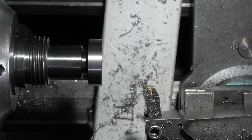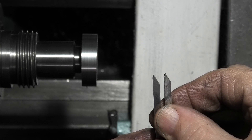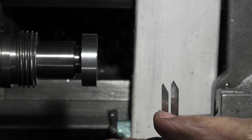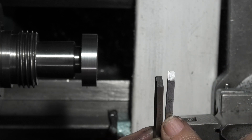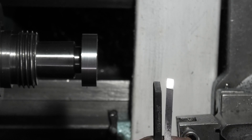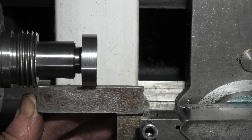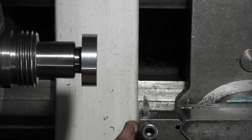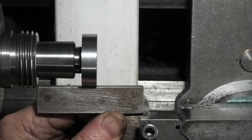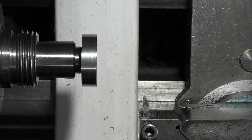Half a thou lift — I'll leave that. I have two thread cutting tools here and the one I want is the 55 degree one. The only difference between the two is one is 60 degrees and one is 55, and it should tell you on the tool itself. I'm using a square to get the tool square to the part — ensure that the edge of your square is on the tool, not on the tool holder. It goes right up to the tool and I can see that it's square.